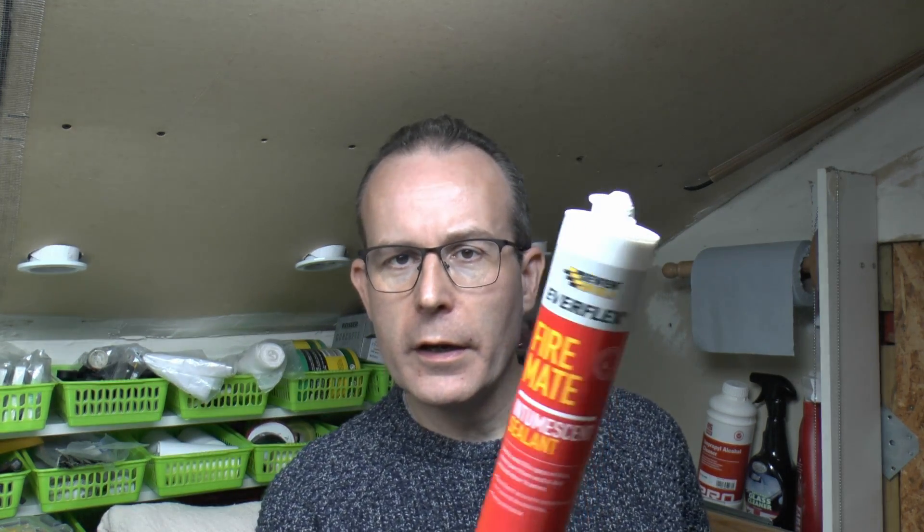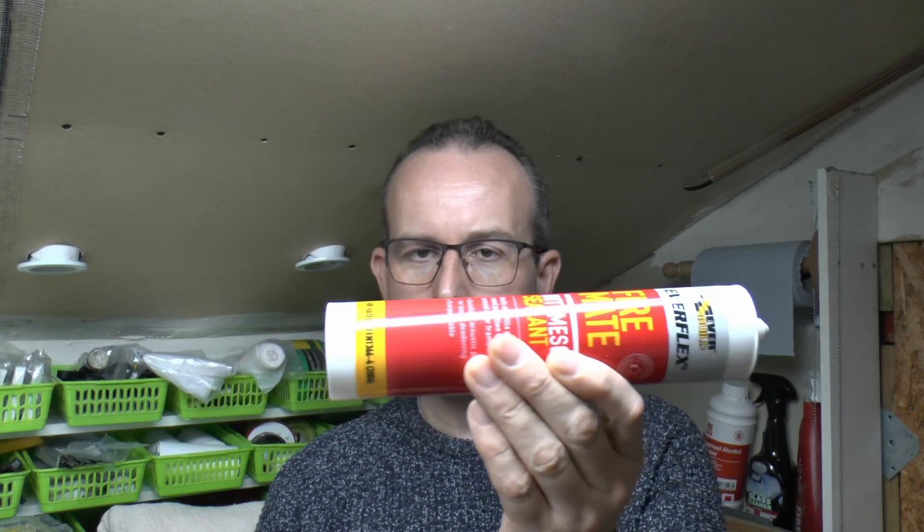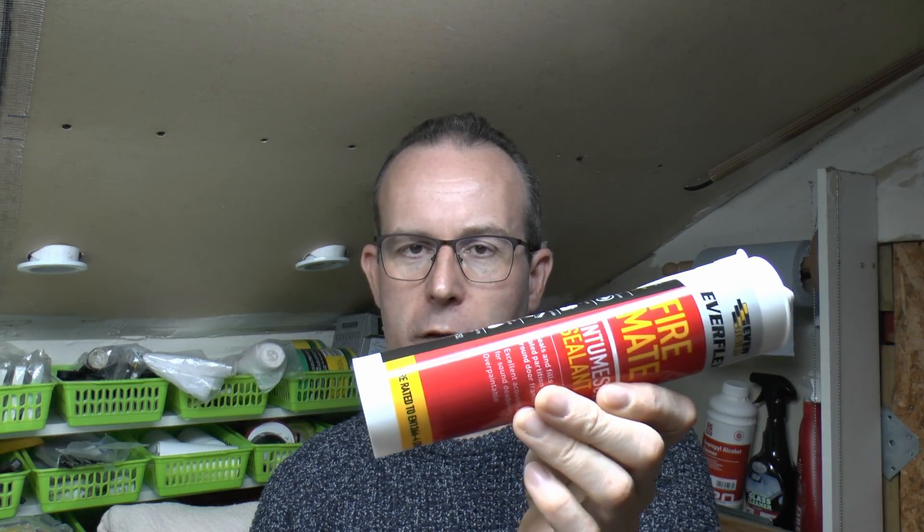Hello, I'm JW. Today we're going to have a look at another type of fire sealant and I've got a piece of it here. Now this actually came out of an installation so it's been in there for well over a year and it's had plenty of time to fully set, solidify, and do whatever else it does. It's this one which comes in this cartridge here — just a white paste material — used to put around things like cables and pipes where you've drilled a hole through a fire barrier such as a wall or ceiling, designed to not have flames going through it.